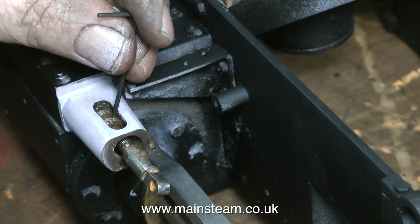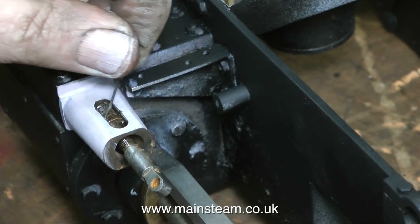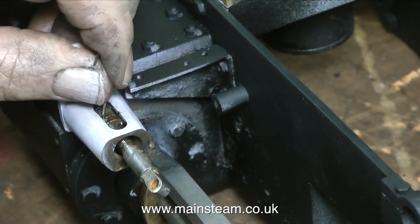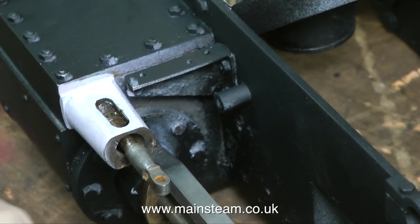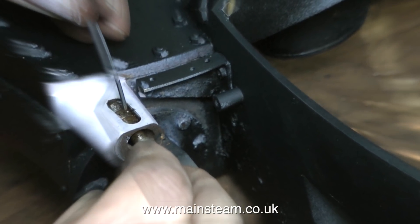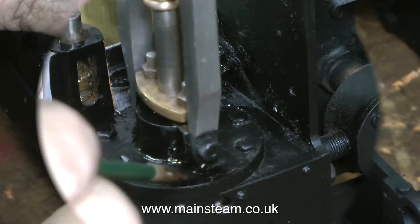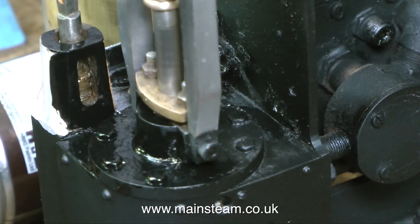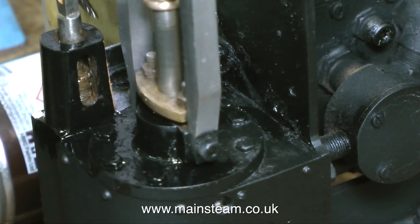This seems to me to be a very strange design. The part of the steam chest that I painted with etch primer is a casting that's been machined, and I think this is designed to look like a valve guide which is commonly found on steam locomotives, but in this case it's non-functional — it's just a nice shape on the steam chest. The slot in it allows me to do this, but it takes ages — it really does take a long time. Oh no, the voices have started again, and now I'm going to have to take my medication and go and lie in a dark room for several hours. But before I do that I'll just finish the painting on the end of the cylinder, including painting the etch primer casting that is stopping me from adjusting the gland nut properly. This is a view from underneath, so you can imagine that when the running boards are on, adjusting this from underneath using the same principle of the two allen keys would be quite difficult.